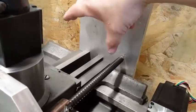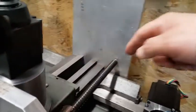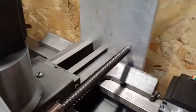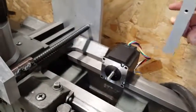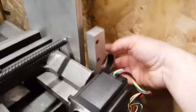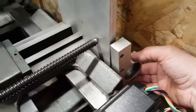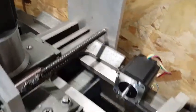I'm going to make a little one-and-a-half-inch wide block that grabs hold of the ways and is bolted to this plate. I'm also going to utilize the two bolts that are in the back of the cross slide where traditionally you mount the taper attachment. And this is the bracket that is going to drive the z-axis from the back using that one-inch diameter ball screw, mounting on the edge of this plate down below the height of the bed.